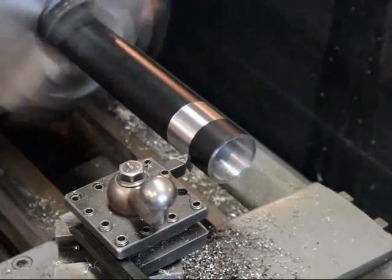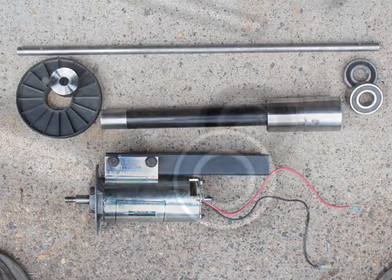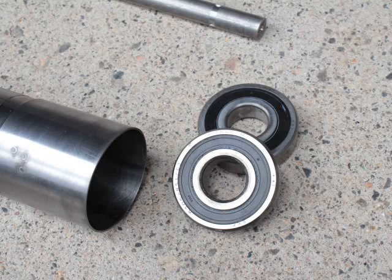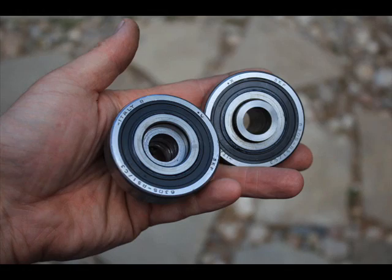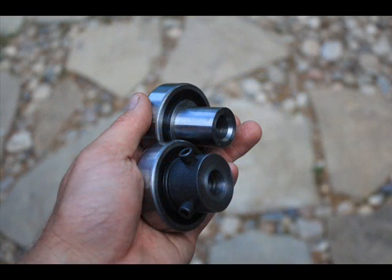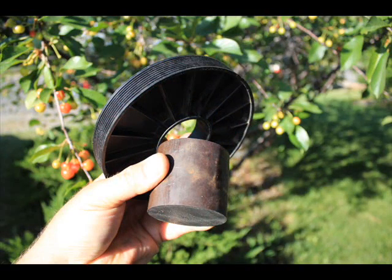Basically it was a matter of just machining it down to the size that I wanted. There was a hunk of steel here or there that wasn't part of the exercise equipment. I made bushings that held the bearings together, and there's virtually no run-out or end play on it.